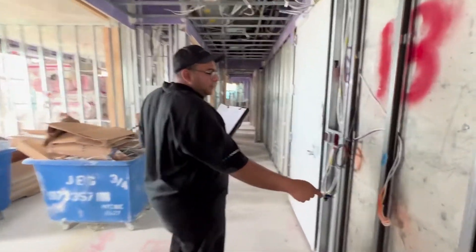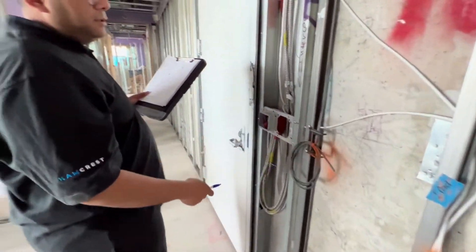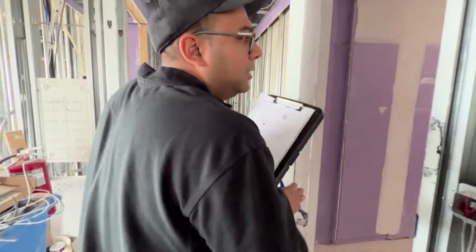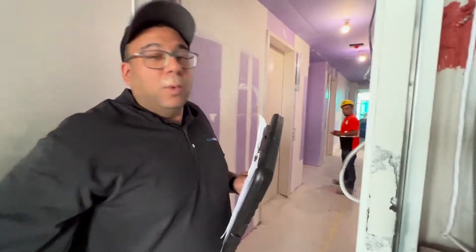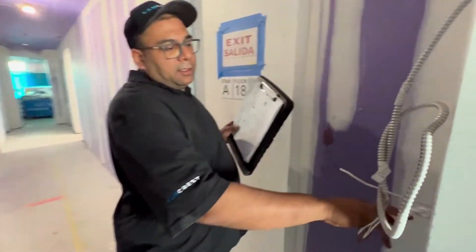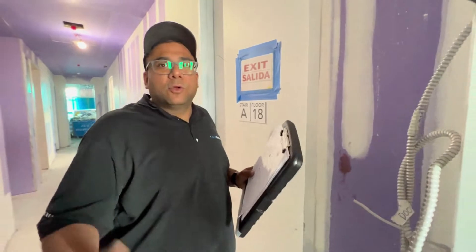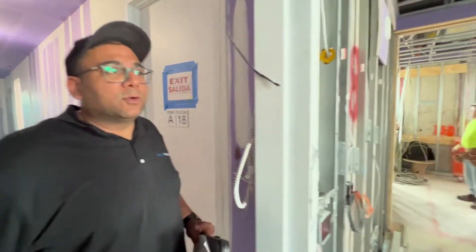Moving forward — this is my iPad wire, and this is your building intercom. On the front door there was no doorbell or any kind of wiring, so what I did was put an Ethernet and a low-voltage wire here. That way, just in case you want to do a video doorbell or something of that nature, you have a doorbell scenario covered.